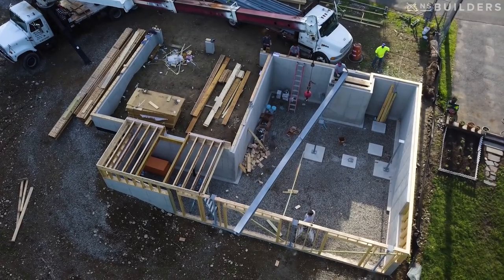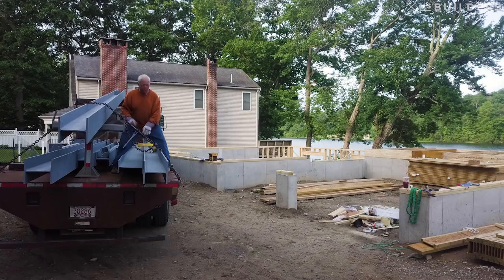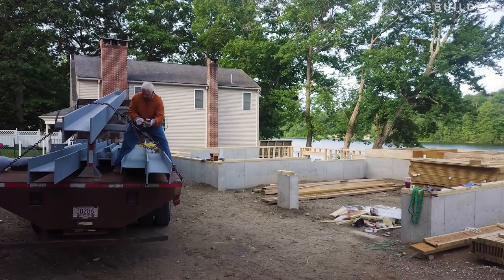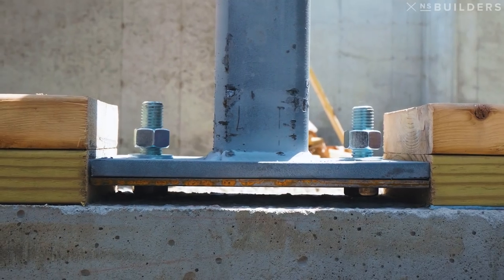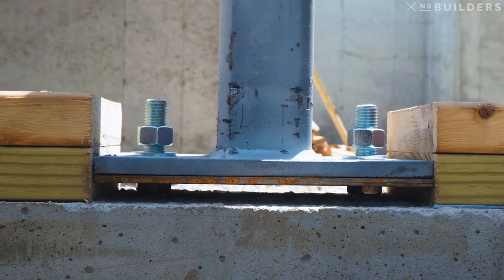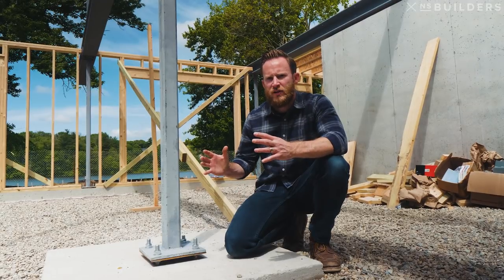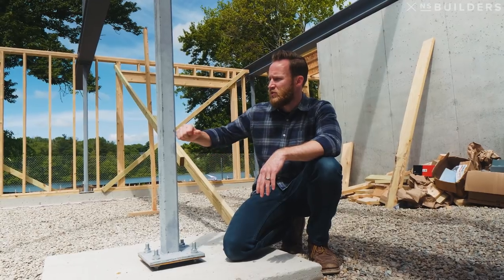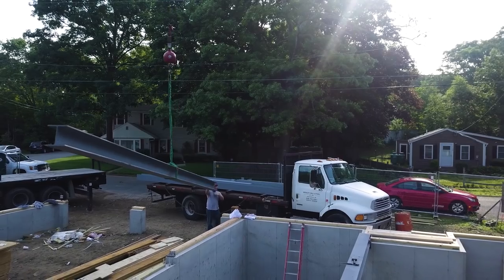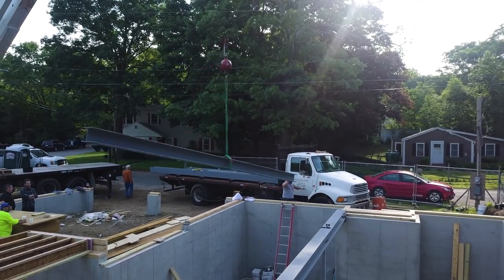I want to talk a little bit about how we came up with our installation process. We opted for a leveling plate method — everything was prefabricated in the shop and is all bolted together. The nice thing is there are split washers under these leveling plates, which allows us to adjust the height of these posts up and down. The framer was on site this morning as the steel was going in, and we got everything relatively close. But as we start running our floor joists across the deck, we're able to adjust these posts and get everything exactly where it needs to be — that's the benefit of a prefabricated unit with the ability to adjust on the fly.